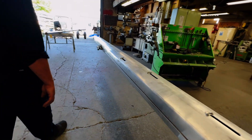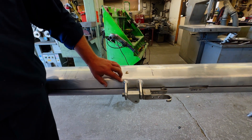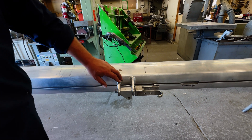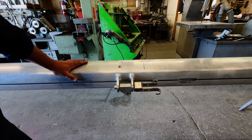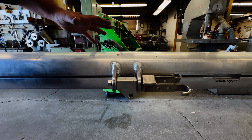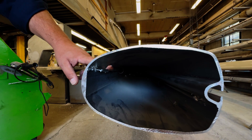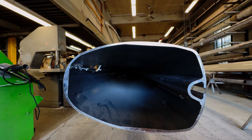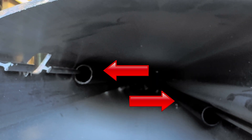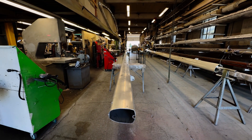As we work our way towards the bottom of the mast, any high load components are welded on, hand cut on a bandsaw and fabricated and finished by hand to give a sleek smooth look, then welded on — again equalizing the pressure throughout so that not one part can fail. At the bottom of the mast, there is a large wire exit hole. This allows for any cabling to exit the bottom of the mast, and there are two tubes within the mast to allow for electrical conduits. This gives us the ability to segregate any electrical wires from any moving halyards internal.